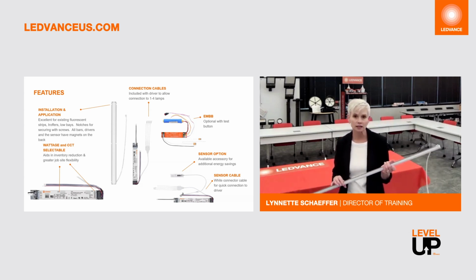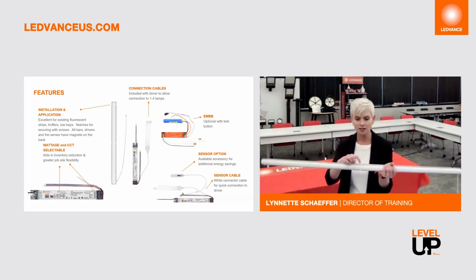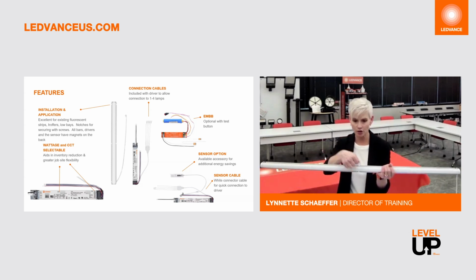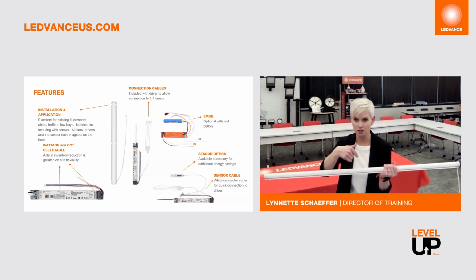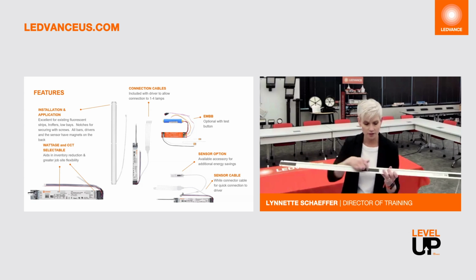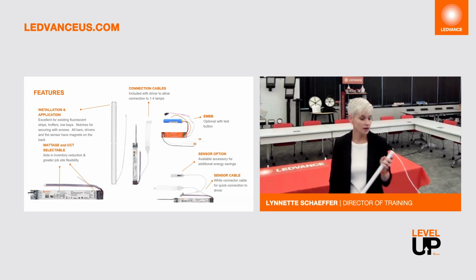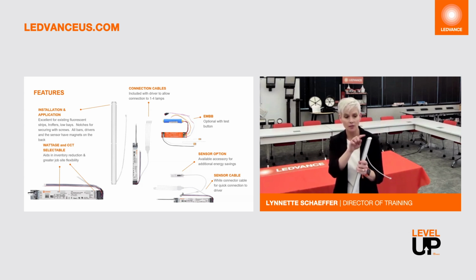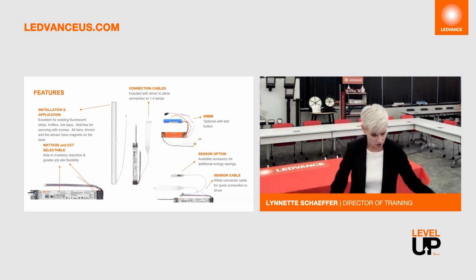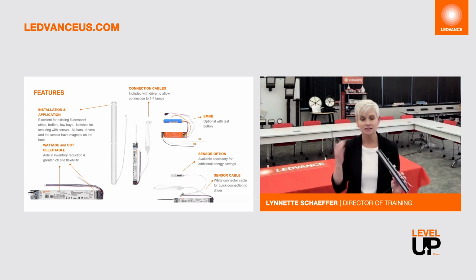Additionally, what's kind of cool about this product is that each light bar, and this is one of the light bars, has these little notches in them so that you can easily secure them to the existing fixture housing. And there's also this magnetic backing, as you can see here on the back of this one. Not only are there magnets on the back of each light bar, there's also magnets on the back of each driver. And if you're going to use the sensor, that's optional, they also have magnets on the back of those too.